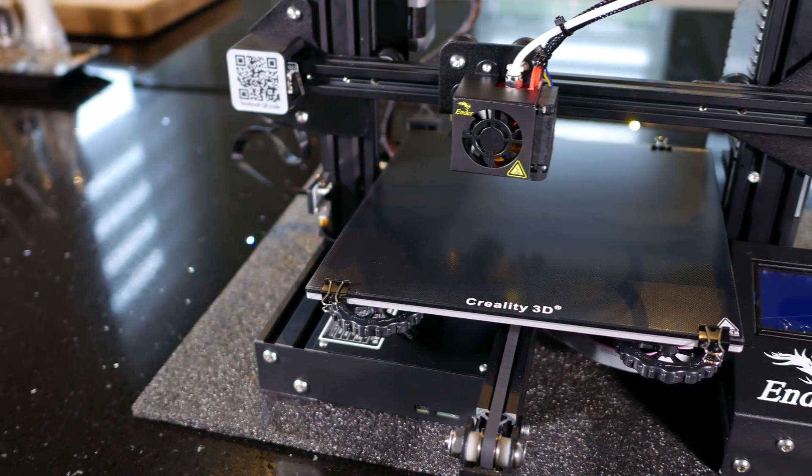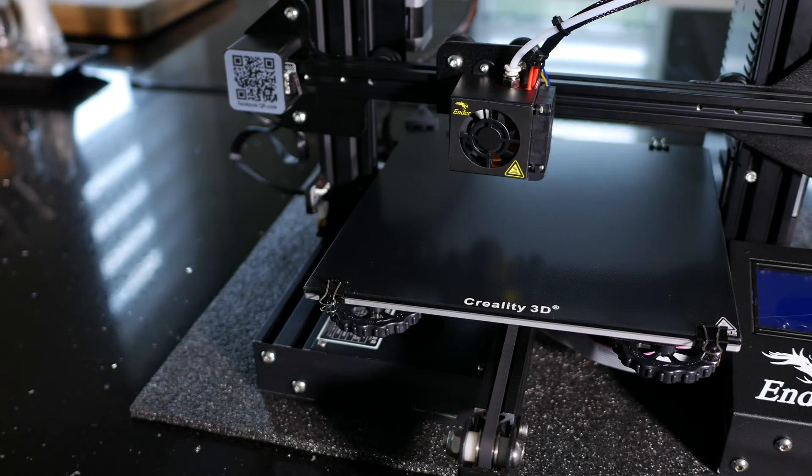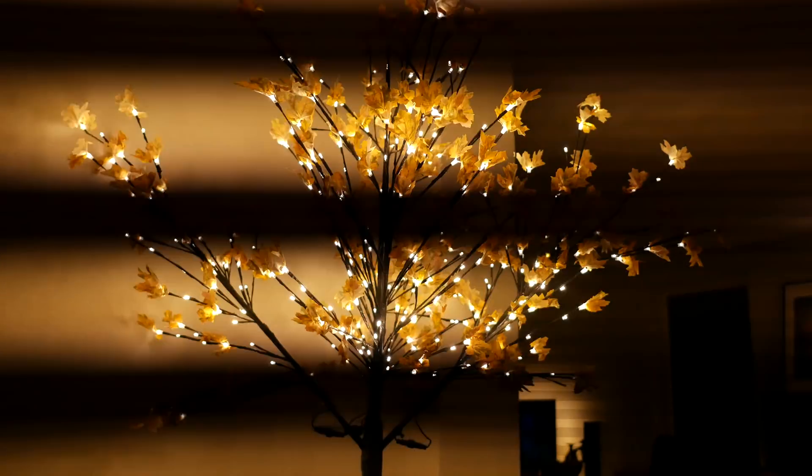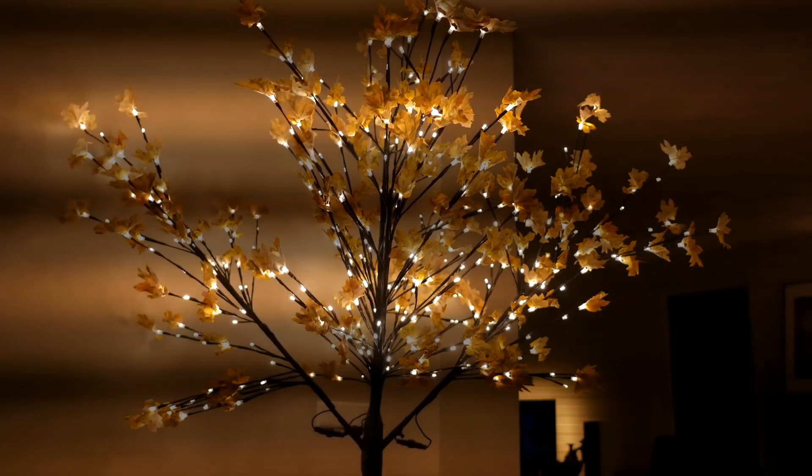I accidentally left the kitchen stove lights on during one of the shots, and as you can see, it's obviously visible — it doesn't look that nice on video. Another example is this new light we bought. This one actually flickers at such a low PWM frequency that I was able to perceive it in real life. Especially when you move your hand in front of those LED lights that are dimmed at too low a frequency, you get a sort of motion strobe effect.